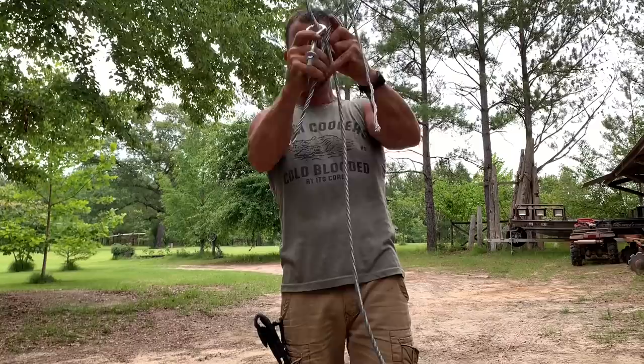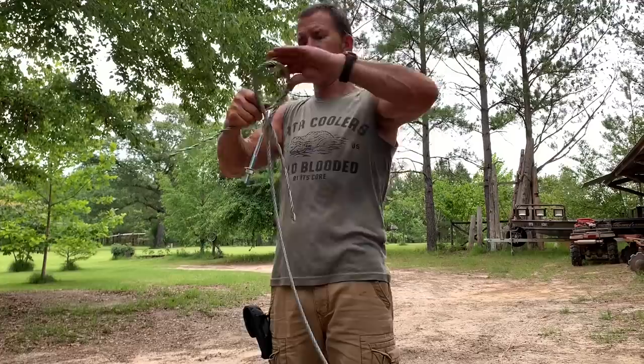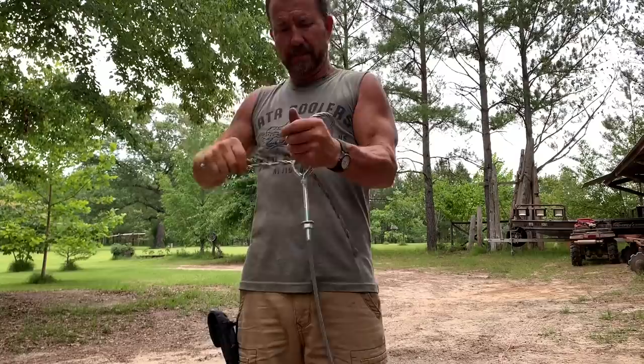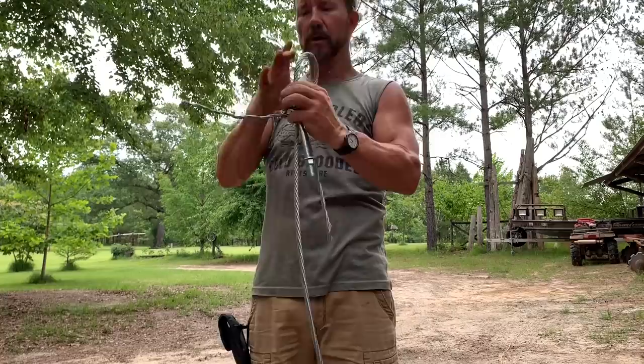Let's finish this side up. Do the same thing. Okay, and you can see it threading. Y'all can see it threading right back in there like it's supposed to. Now I'm making one more revolution, one more inside pass with this one. I don't know, I may have to back up a point. But let's see. That's super tight right there. That's really pushing it. So if it's pushing it, don't do it. Just back out one.